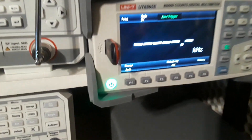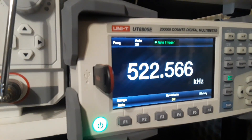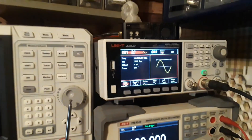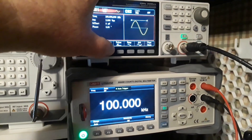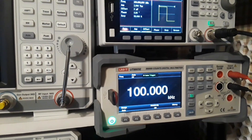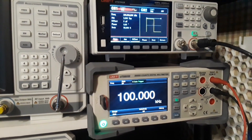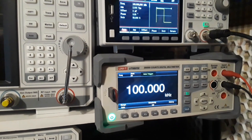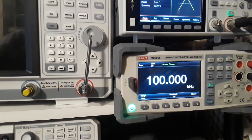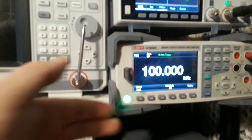I'm going to pick a more reasonable frequency — say 100 kilohertz — and throw some different waveforms at it. We've been using a sine wave, so let's try a square wave. If you've done signal integrity work you'll know about crest error — by not using a sine wave we introduce some crest error. 100 kilohertz square wave, no problem. Triangle wave — yeah, no worries at all. This is just a rock solid piece of test gear.